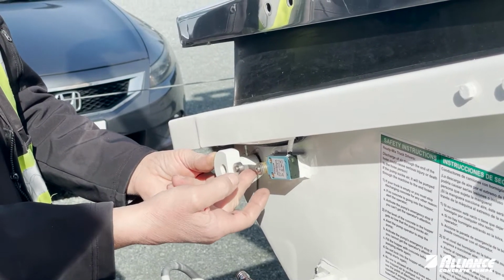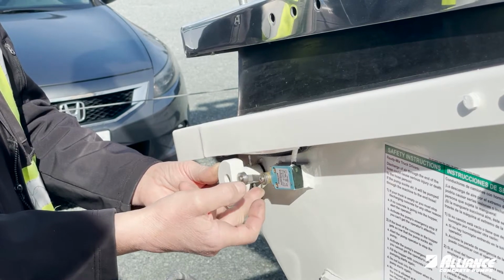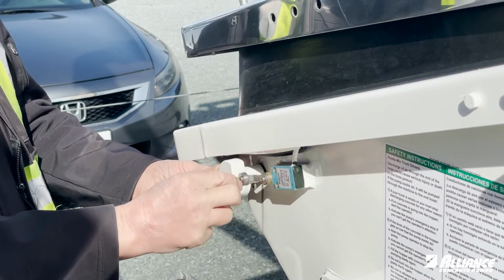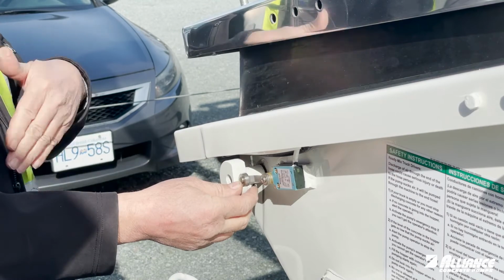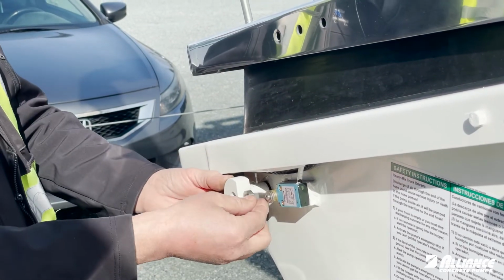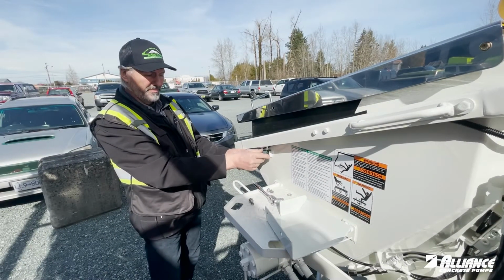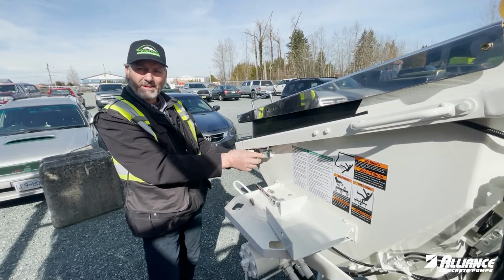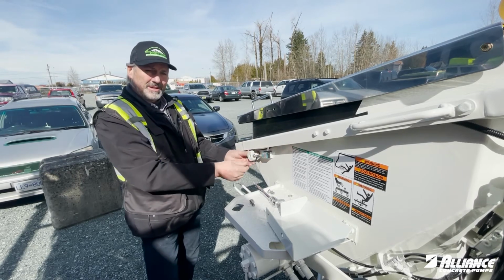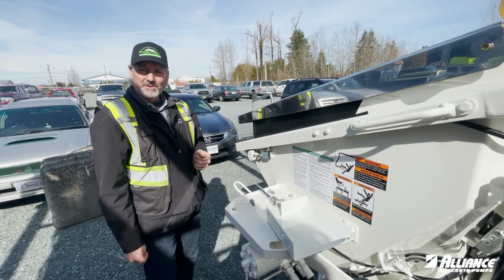You hear it click. Now when that grate comes down, you want to hear the click, and if there's concrete built up here, it won't, and that's going to put us in e-stop mode and you can't pump. So pull it off, check it, clean it. You may even have to tighten the little screw, or occasionally a switch will fail. So when that's in good shape, your grate is closed and it gives you the all clear for you to pump.